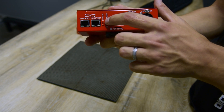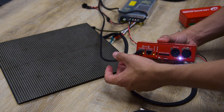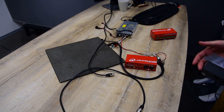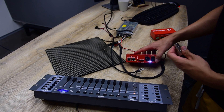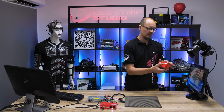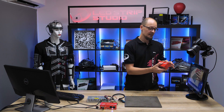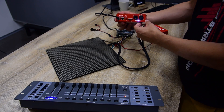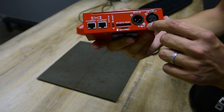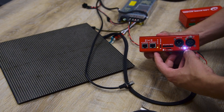The first one shines red in case your device is connected to the PC and to our LEDstrip Studio software. The second diode flashes rapidly in yellow in case any DMX signal is flowing into the device, and it flashes more slowly in case an Artnet signal is flowing in. The last diode shines green in case your device has power. This little diode here shines white in case the two XLR ports are in a DMX through mode.